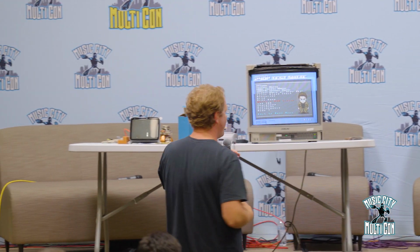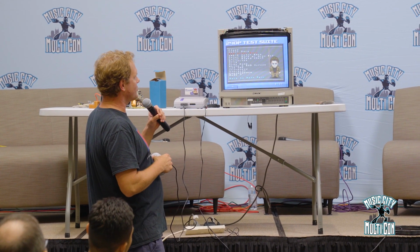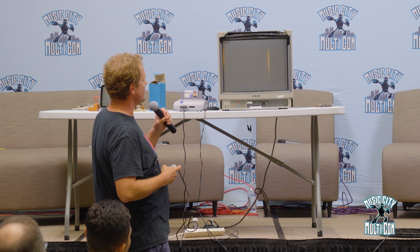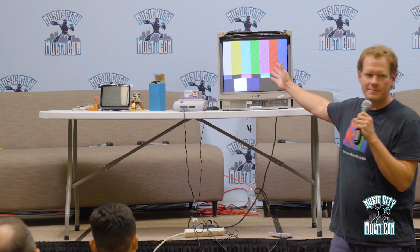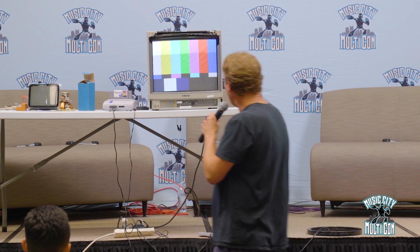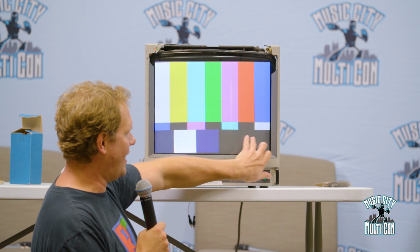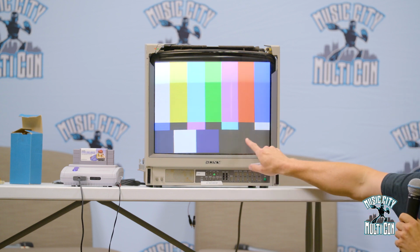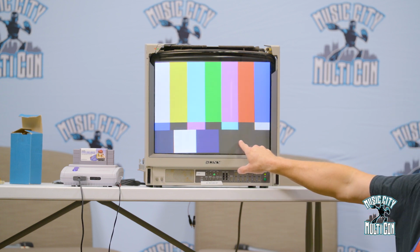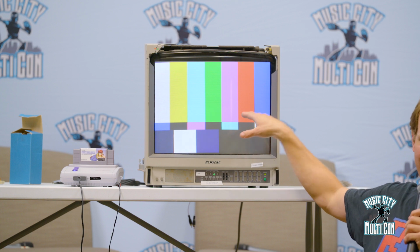There's this toolkit that I've been showing you that is loaded. I've only gone through a couple of tools with you, but it's filled with great tools. And one of them is this. Probably some of you have seen this before, like a color bar. It's very difficult to see from where you're sitting, but this is three different black cubes. Within this middle cube, there are three individual lines. I can see them because I'm right here, but you need to set your brightness and contrast so you can barely see them.